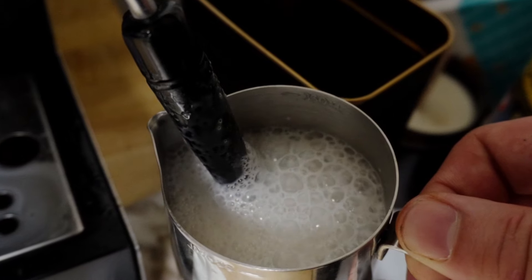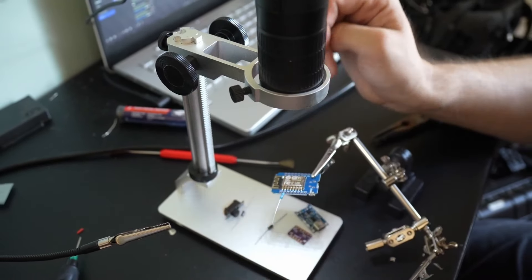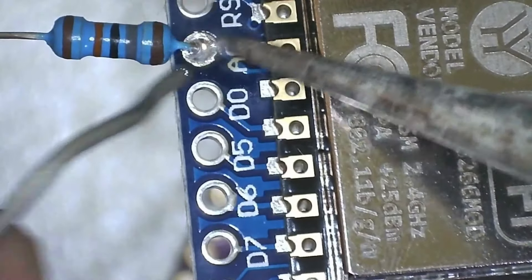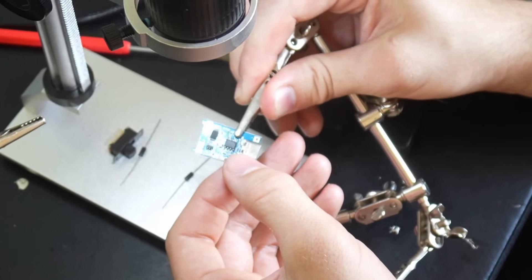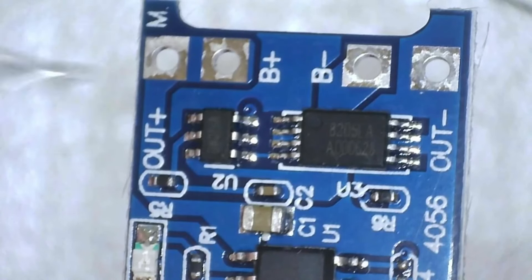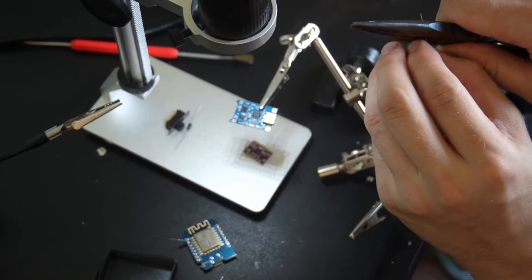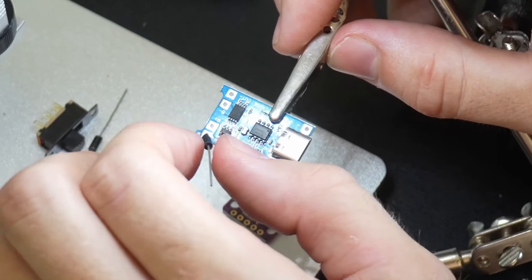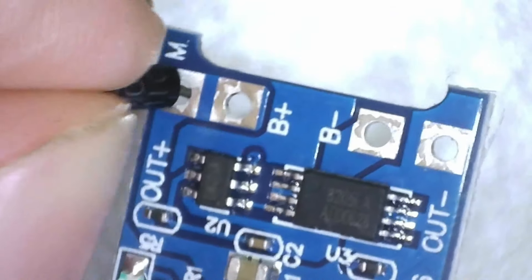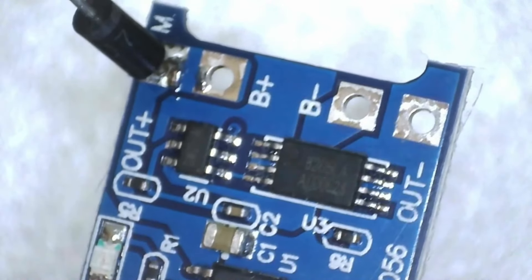So to begin with, what we want to do is put our resistor on our control board. The resistor is going to monitor how much battery life is left on the tracker, and this is going to go into the A0 port on our board. Next are our diodes. An important thing to make sure is that the gray part on the diode is pointing upwards. I like to trim the diode before putting it in the port. It's important to have these diodes if you plan on charging your trackers while using them, because they prohibit your board from completely frying up during use while charging.